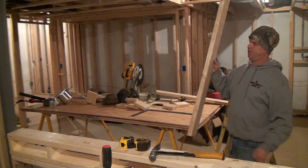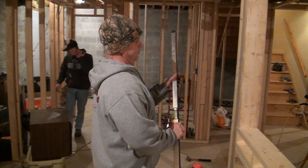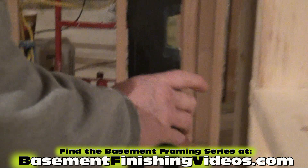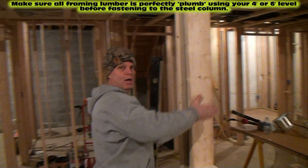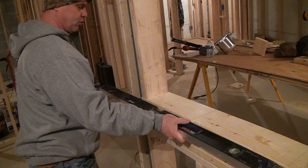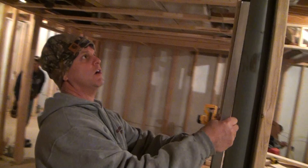This will be my finishing piece — it'll go right up under here like this. We'll make sure it's nice and straight up and down. I show how I do the half wall in another video in the framing series. To recap, I had to make sure the half wall was nice and level, bubble between the lines. I'm going to do the same thing with this piece of lumber — get my level on there. It looks pretty good right where it's sitting. You want to make sure you're plumb — straight up and down. Put your level on the side of the half wall and make sure these two pieces of wood are coming right off your half wall so everything is nice and straight across.